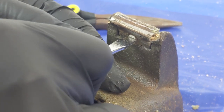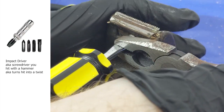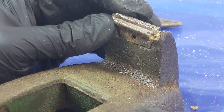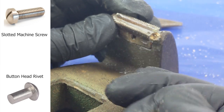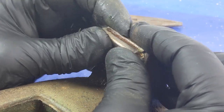After cutting the slot I got out a stubby screwdriver and a set of pliers to use as a makeshift impact driver. A normal impact driver is something you hit with a hammer and it turns that striking force into a rotational force for getting out stuck screws. With this method I just use my thumb to hold pressure on the screw and the pliers provide the rotation. It turned out to actually be a rivet, which would have probably had a button-shaped head, not a flat slotted head. A screw usually has a slotted head and a threaded shaft, whereas a rivet is usually hit with something like a hammer and deforms into shape holding whatever it's meant to hold in place.